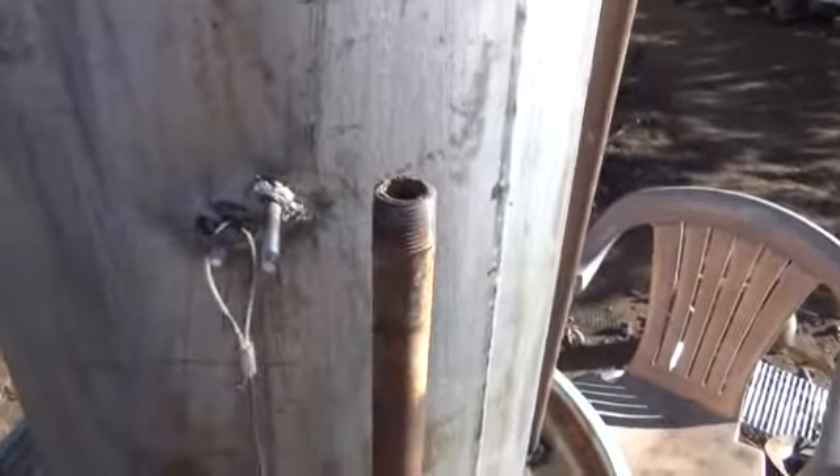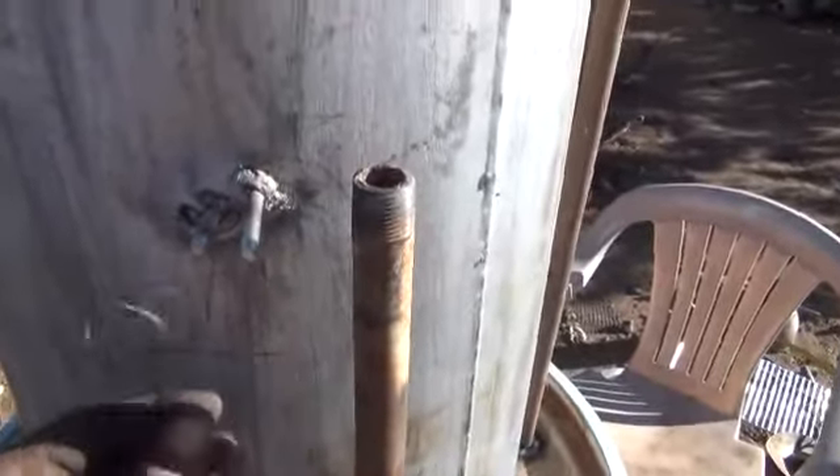The grate catches itself on the lower prongs. There are two bolts: one keeps it at a rigid point, and if I want a little bounce — like when going down a road — I can adjust to the lower position to give it just a little play so it can shake debris off on its own. The washer and lock nut go on, tighten it all the way down so it can't slip, and that's done.